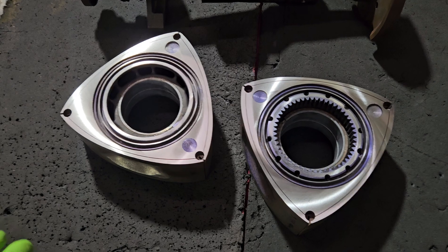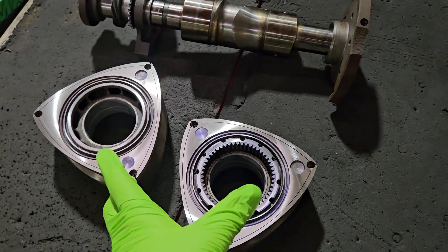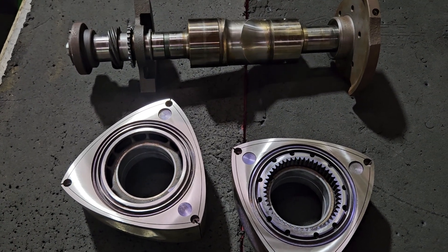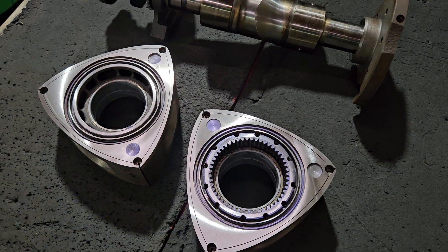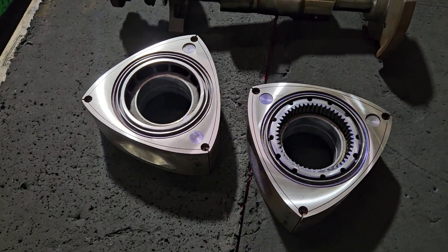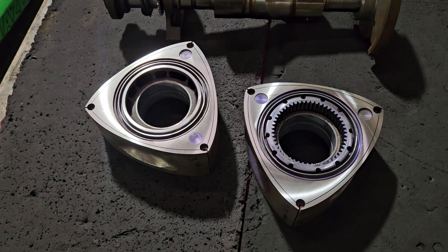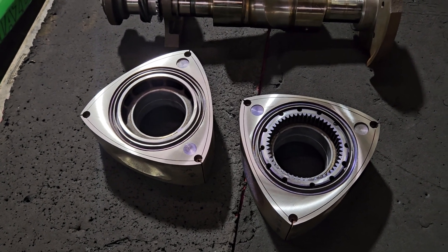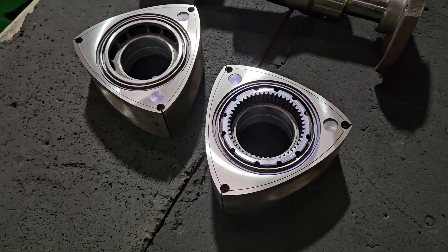That's why having good oil pressure, good straight shafts, a balanced rotating assembly — all of these things go together to achieve high performance and reliability. But at the root of it, one of the more inexpensive things to have a professional rotary shop do — and I don't really recommend doing it at home, even though it seems simple — it's a good way to mess up a perfectly good set of rotors if you get it wrong, is tip clearancing or side clearancing.